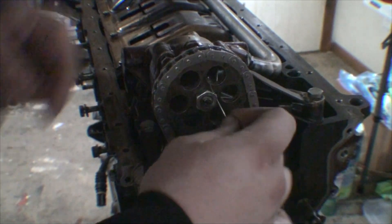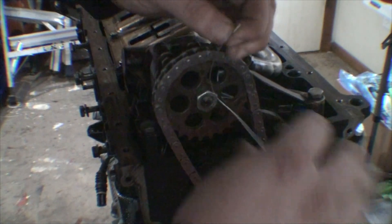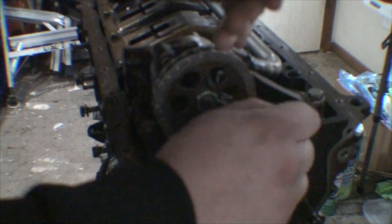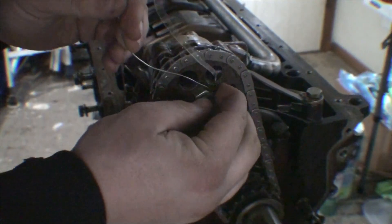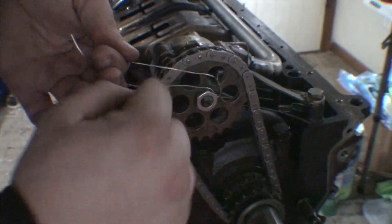So we're starting with our safety wire. We're going to run it through the hole that we drilled in the nut. We want to get this relatively equal length. We're going to be safety wiring it to this portion of the sprocket, so we're going to have a slightly longer lead on this end of the wire since this end of the wire needs to come this way.